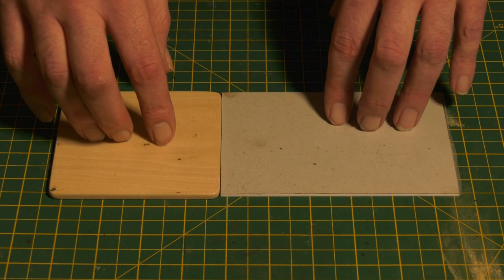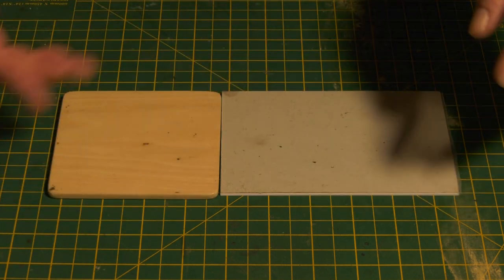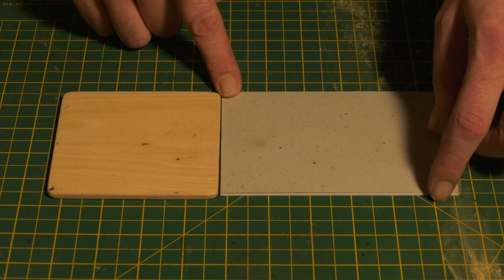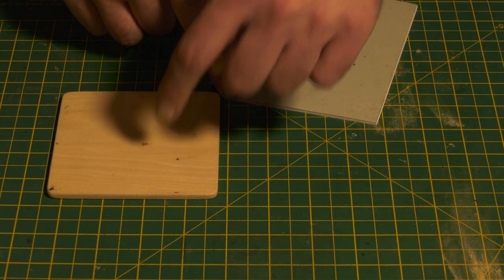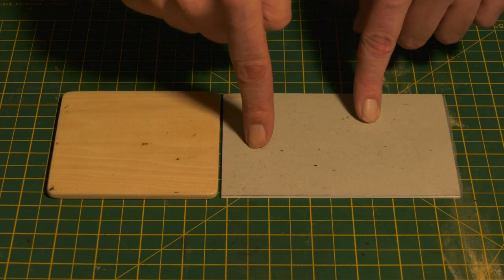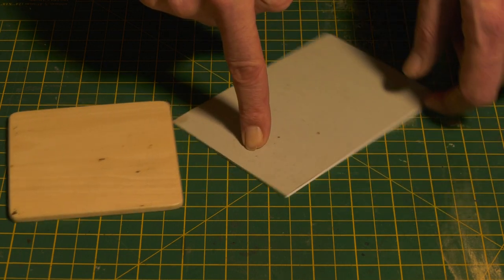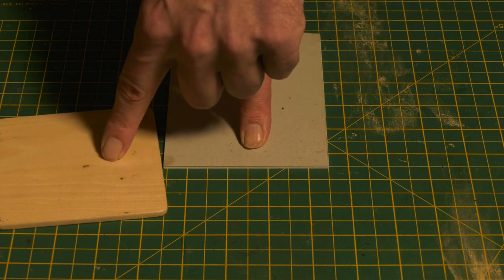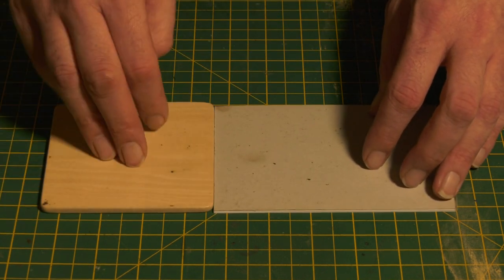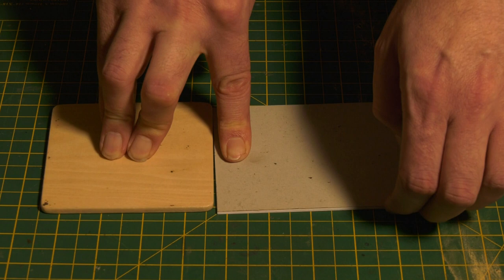Here's a mock-up, forgive me, it's not to scale, but this piece here would be your door, and that would be your corner post or your door frame. As we've just discussed, on a full-size door, with the pin hinge being here, that enables the door to move out and away from the frame, and it goes back in rather neatly. However, you change that to a pin that's pivoted at this point, and it changes the whole nature of the way the door moves. Observe. Bonk! This whole back end collides and crashes into this, and because it's a mock-up, it's able to knock this completely out of the way. However, if this was a fixed point, and we swivel it like this, it won't move. It will want to move, but it won't.